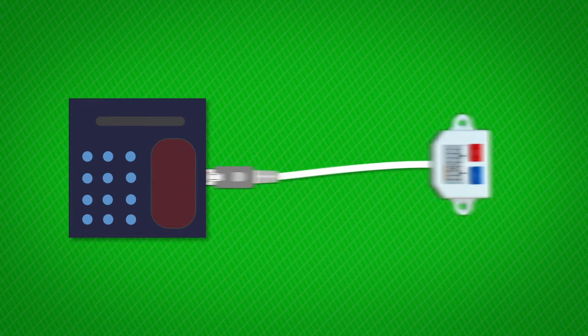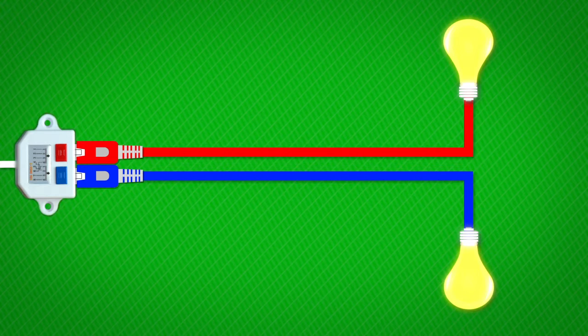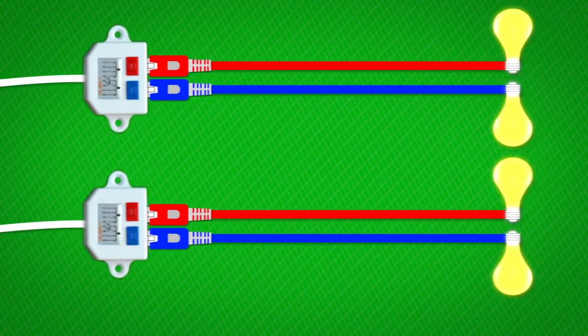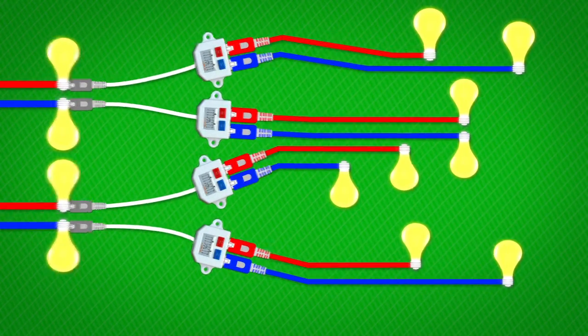Let's take a look at an example using a lighting system. You can plug the splitter into the control hub, then split the signal to two lights instead of one. For some applications, this can then be daisy-chained into a whole series of lights so that one control signal can communicate with an entire array.